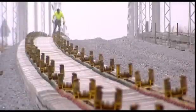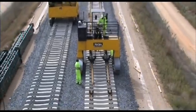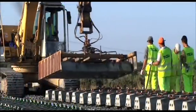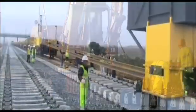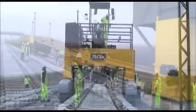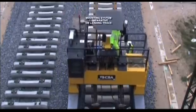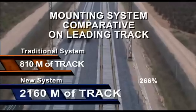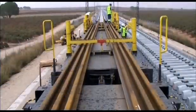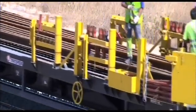With the TEXA system, using the unloading track gate directly on the railway sleepers and rolling, the only requirement to unload the track and start mounting is to have double the sleepers needed, positioned to cover the length that the machine is able to unload on the leading track — currently eight long welded bars, 2,160 metres long. Having the sleepers positioned at double their length allows the rolling to make progress and keeps a distance between the mounting and the positioning.